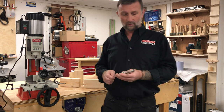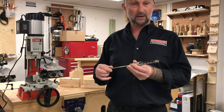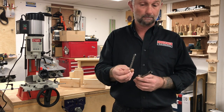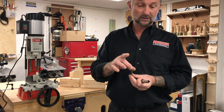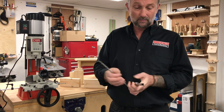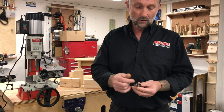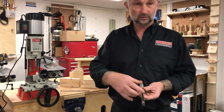This is the key to that machine — the chisel and bit. This is the hollow chisel, and this is the bit, like a regular auger bit. We've got a sharp cutter, a centre point to keep you central, and a wide channel to take away the waste. Then we've got the square, four-cornered, super sharp chisel. The bit runs through with a window on the side to let the waste draw out.